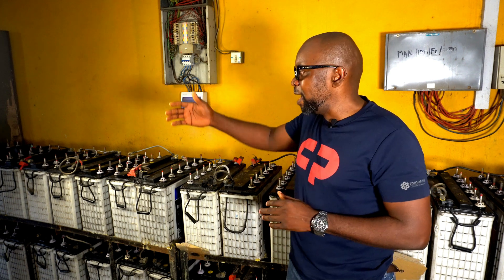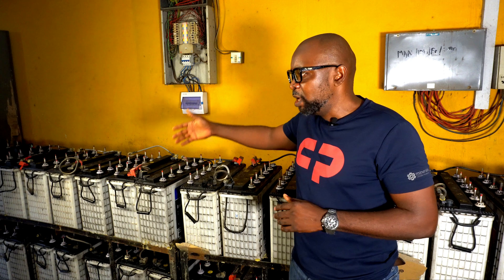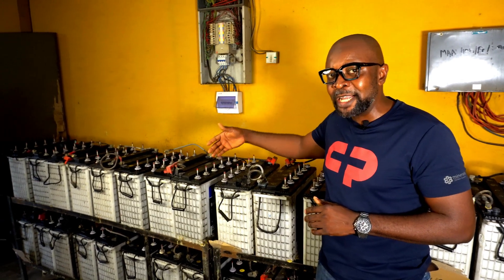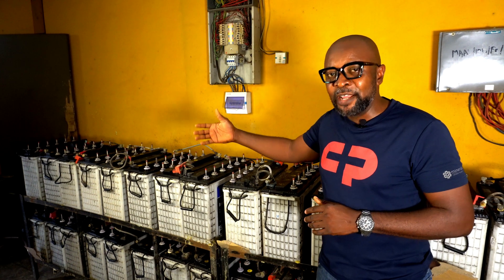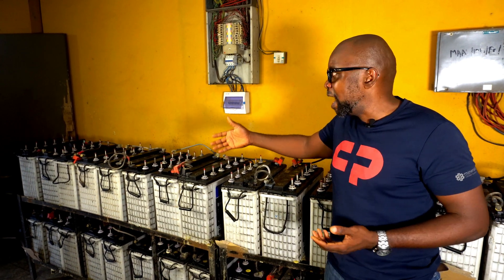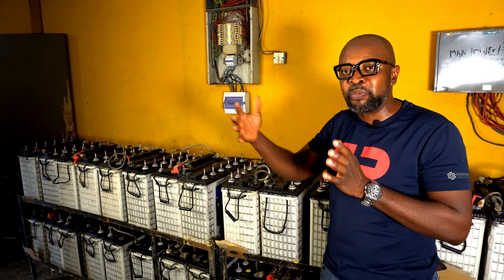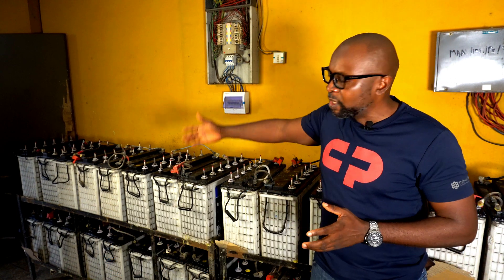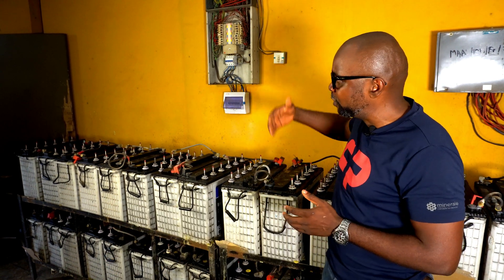If you don't do that, because you have so many batteries, some batteries might begin to fail — some will be overcharged and some will be undercharged. If that happens, some batteries will begin to die off, and once one battery dies it will put pressure on the others. So make sure that whenever you're connecting this large fleet of batteries, you have some form of battery management system present.